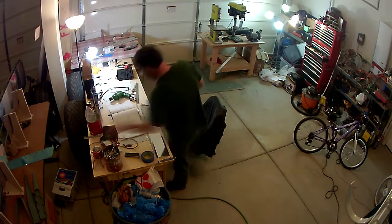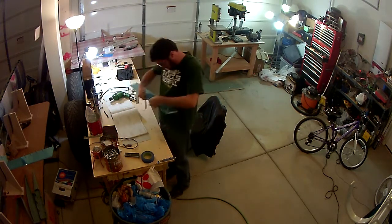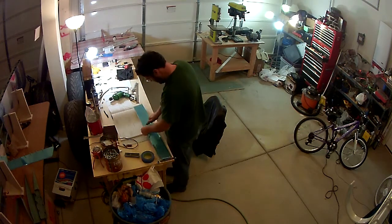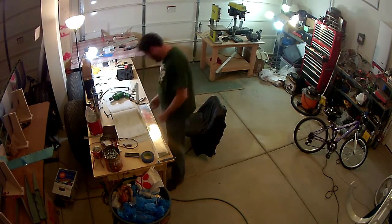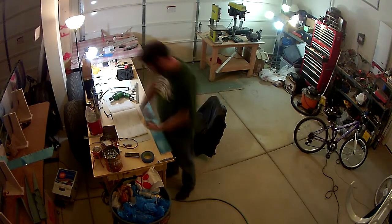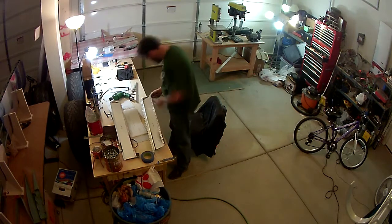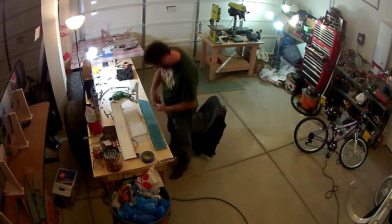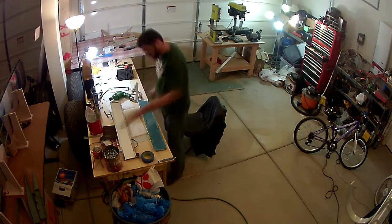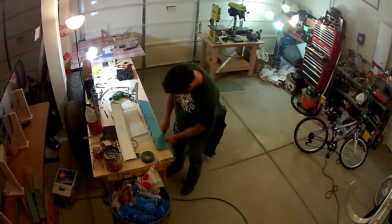And you do that so that the double-sided tape, you'll use double-sided tape on the upper skin and lower skin where it attaches to the trailing edge spacer, just as an extra, I guess, insurance that it stays in place. I'm not entirely sure why the double-sided tape is there, but it's the same thing I did on the rudder, and you'll do it here also, both here and on the trailing edge of the elevators.